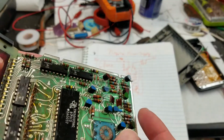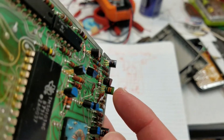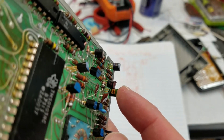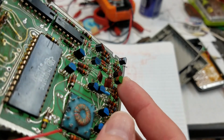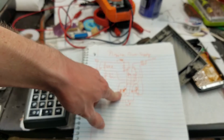I tried guessing that maybe they represent just numbers like the resistors do. So for example, that one's green, orange, orange. So that would be 533, or in reverse 335. Or if we take into account the top, which is green, 5335 both directions. But searching for those numbers didn't really seem to provide anything coherent. So I don't know what these transistors are. And I've just taken a guess whether they're NPN or PNP based on their operation in the circuit.